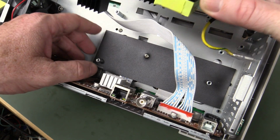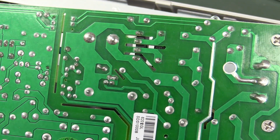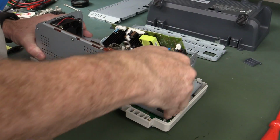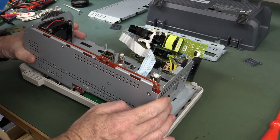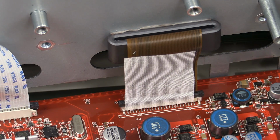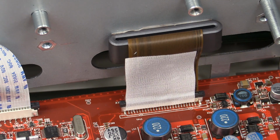Elephant hide on the bottom. They're just insulating the backside of the board, for those playing along at home. Look at that, nice touch. High voltage isolation slots between each pin of the bridge rectifier. Neat. Okay, so all this is supposed to pop out. No, got to undo the ribbon cables first. Oh, ourselves a nice big juicy ferrite right across the main LCD ribbon cable there. Could that be a last minute EMI oopsie perhaps?